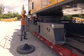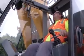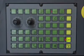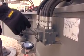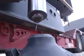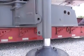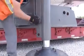Fold out the cylinders from their parking position. In order to activate the cylinders, you first have to operate the safety lever and pre-select the cylinder function on the X23 control panel. Then control is shifted to the jack-up control levers on the undercarriage. Bring the cylinder into the lower pinning position in order to allow for maximum supporting height and then extend the cylinder until contact is made with the ground.